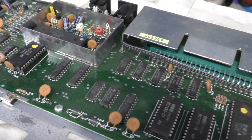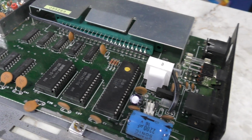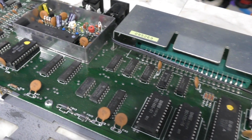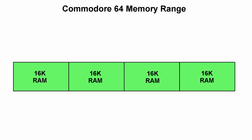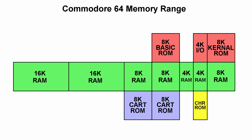The VIC-20 design also has another important aspect. It's super simple. And that was always one of my goals. I wanted the computer to be easy enough for a single person to understand the whole board, and I wanted it to be easy to program. Just as an example, if you look at the C64 memory map, the first 32K is pretty easy to use, but then the rest of the RAM is all shared with different things, and using the last 12K of RAM is actually a real pain in the rear.